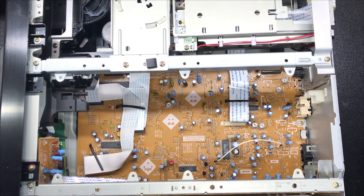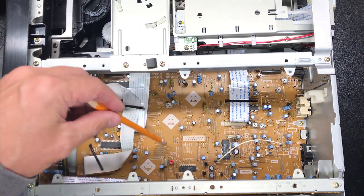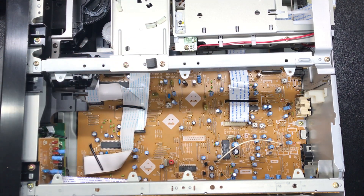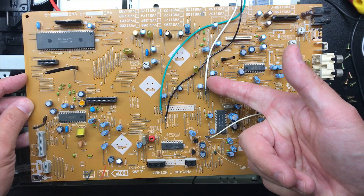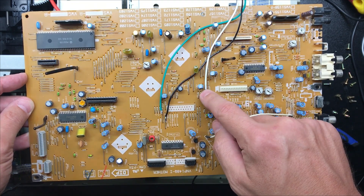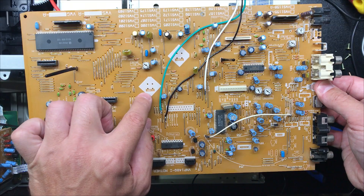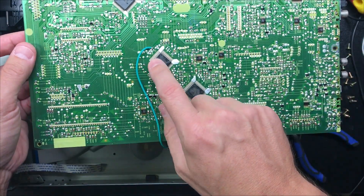I skipped a lot of the prep — I went ahead and took the cover off, powered it up, and ejected the tray. The tray is still attached to the unit and just unplugged from wall power, so it gives me really good access to the board. We've got three tap points that we're going to need. In my initial walkthrough I showed one that was wrong, and it's the most important one — the digital out signal. This is not the right one, so ground and 5 volts are fine right here.